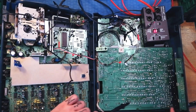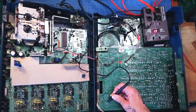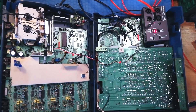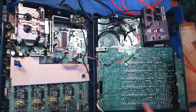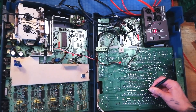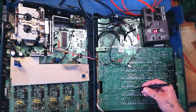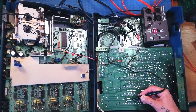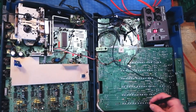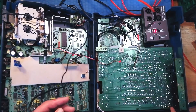There we go — I'd mark that. I'd come down this end, which I know is roughly the end of the fader, until I find that point, then mark it. Then I'd look somewhere in the middle, touching points until I find one, mark that, and find a place halfway between those two. I'd keep halving it down to a point where now I've got nine points along this circuit where on a healthy channel I should be able to find the input signal.